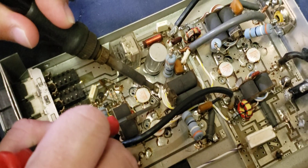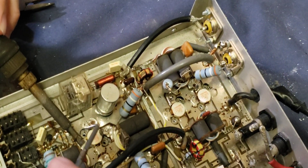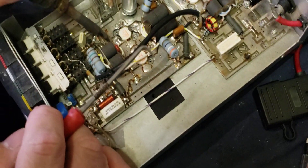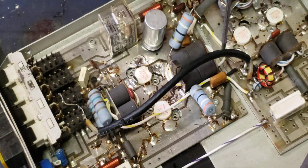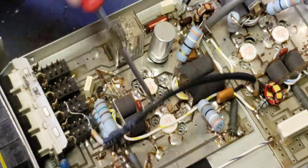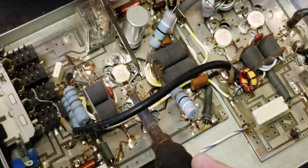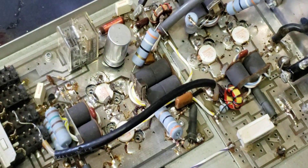Usually I'll get them all lifted first, then see which ones I can suck out. You want to be careful not to get the trace up. That one's bent up. Texas Star — this is an older one, so no Teflon coax here. Somebody's already hit it right here, and if I ever use this amp in the future I'll be removing that. Try to be mindful of what that iron's touching, because sometimes you'll hit something when you're so focused on getting these pill leads out.